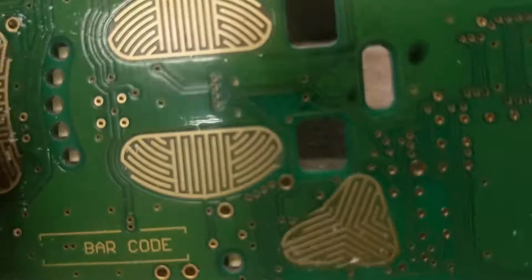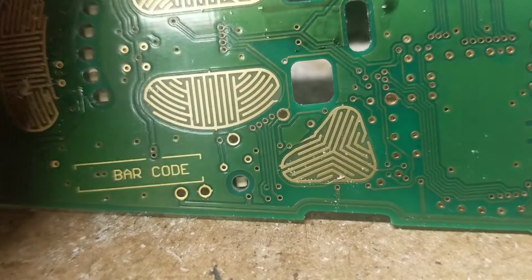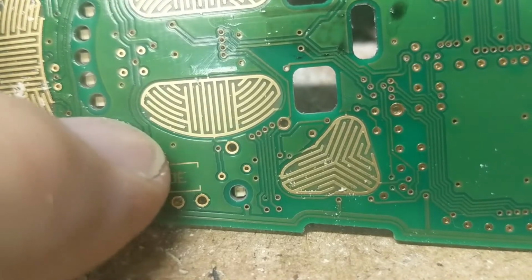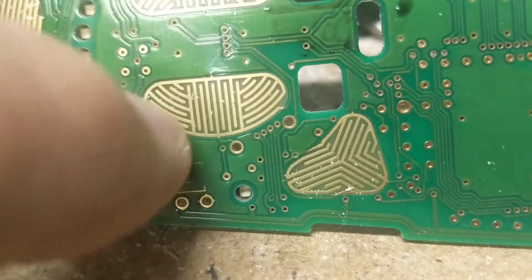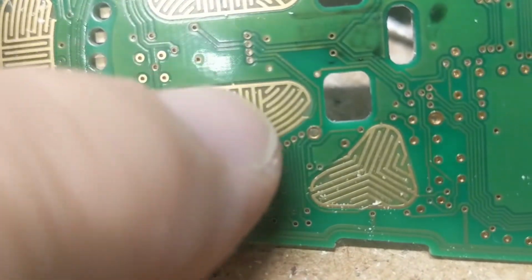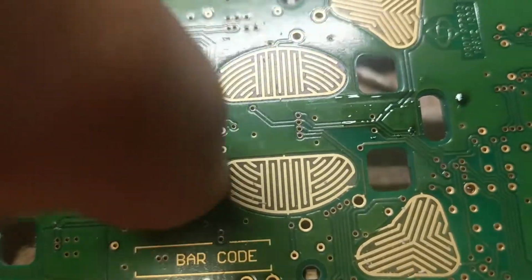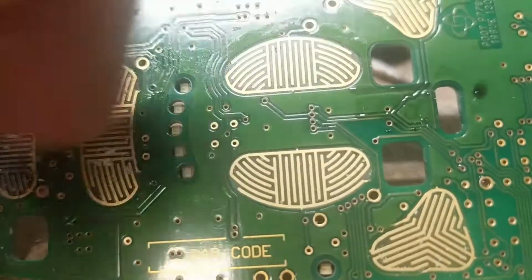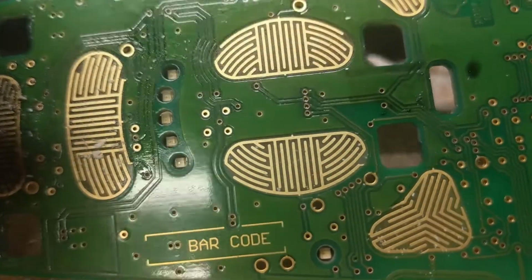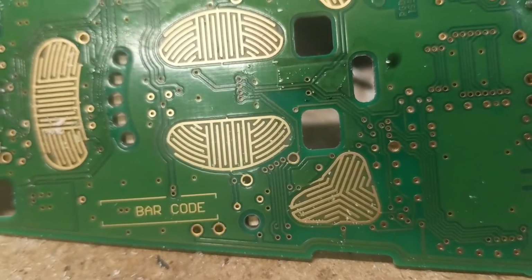All right. So I can follow the circuitry of each one of these, which would be two actually. It's like a maze, and all the button does is wherever you press it, it's going to make a contact at this point. But here, this is actually just two connections. So I will follow it and see which pin, because there are pins here. There's pins all over. Hopefully, if I follow the pins, I can figure out which pins go to which switch. So I'm going to do that, and I'm going to write it down. I'll make a little drawing.